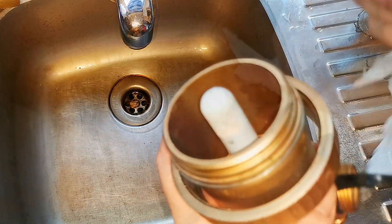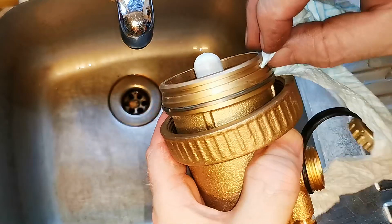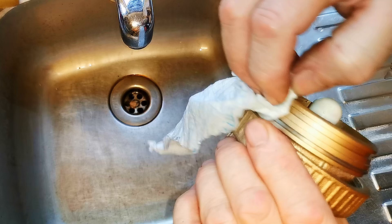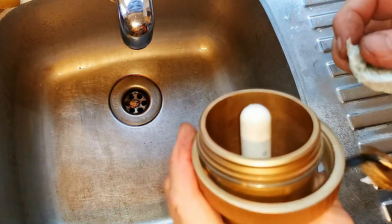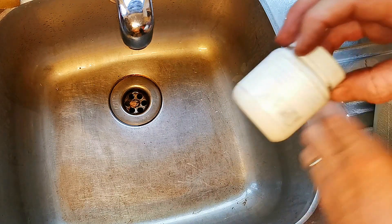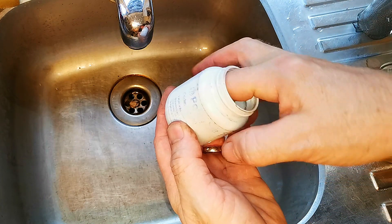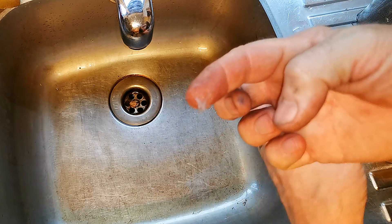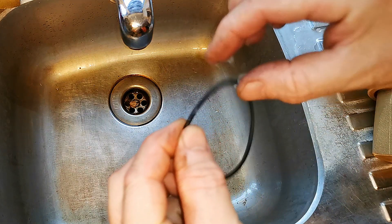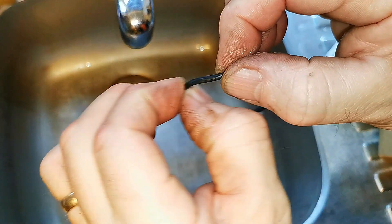That looks nice and clean. We also want to make sure that the filter groove where the seal fits is clean, so again I'm going to get my bit of kitchen roll and make sure that is nice and clean — give that a good old wipe off. Over time you will find there'll be bits of magnetite in there, so make sure that's nice and clean. Now I'm going to get my silicone grease and get a good old blob of that — I'm going to wipe it all over the rubber o-ring just like that. Because I want to make sure that's nice and greased up, as that will stop it from leaking and it'll also extend the life of the o-ring. I'll see if I can find a part number for that o-ring and leave it in the description.